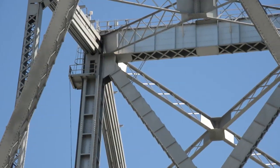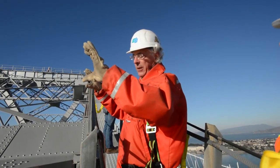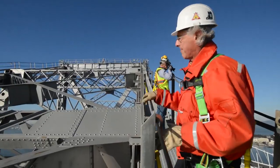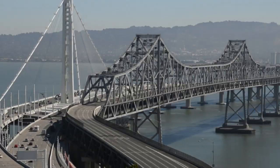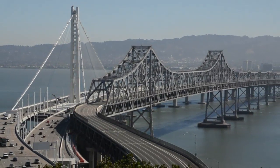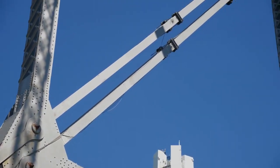When you cut it, you can't let it fall. You don't even want to let it swing. You want it stabilized, completely supported, then you cut it, and in theory it doesn't even move. This was the longest cantilever truss center span in the world. We now have to take it down very, very carefully. We have to manage that energy that's held in this bridge, and that energy can really be dangerous.